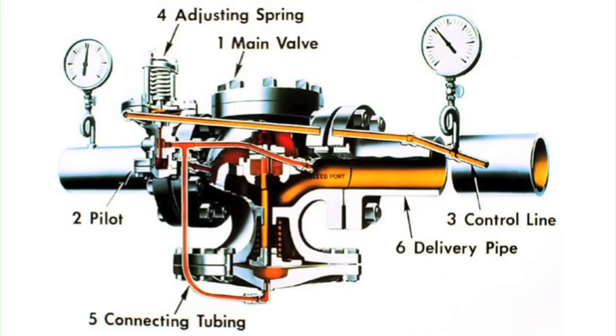The downstream pressure is fed back underneath the diaphragm. When we reach our set point, or have enough force underneath the pilot to overcome the spring tension holding it open, the stem will retract and the pilot will close. Once the pilot closes, the excess pressure under the main diaphragm will bleed off to the downstream bleed port. Once demand picks up, or there is more force on top of the disc than underneath it, the pilot will reopen and continue to maintain a downstream pressure.